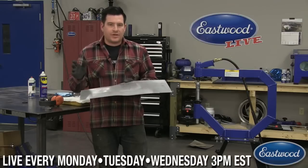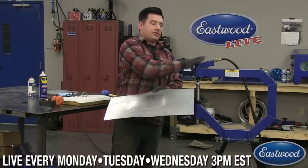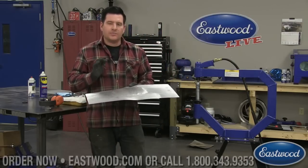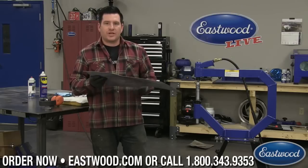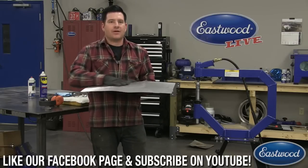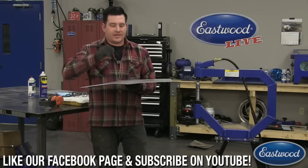So there's a couple of things you can do with the planishing hammer. What I'm doing here is I have the pressure turned down quite low, almost as low as it can go. And all I'm doing now is planishing. This is the same as if you're just lightly tapping with a hammer and dolly and you're smoothing an area out. So we're not actually stretching here, we're just smoothing the area out. We're getting rid of all the highs and lows really quickly because it hits so fast.